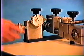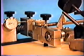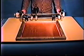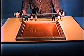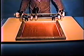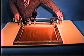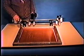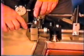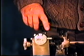Next, make an x-axis adjustment. Now, make the y-axis adjustments. To rotate the screen, move the two y-axis knobs in opposition to each other. At this time, we can accomplish the final off-contact adjustments, and then we can tighten the lock nuts. And finally, we tighten the lock knobs.